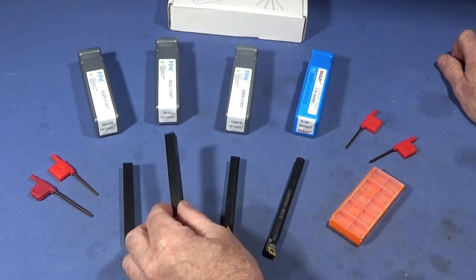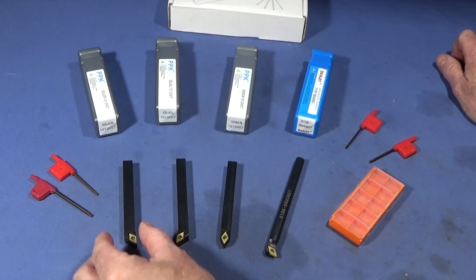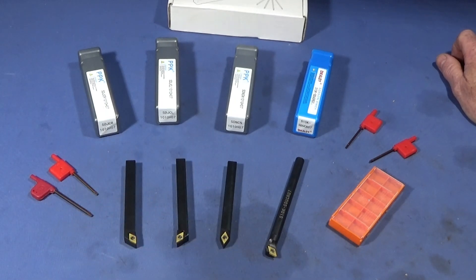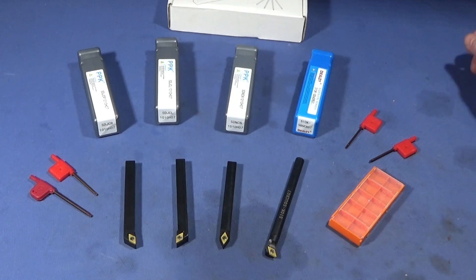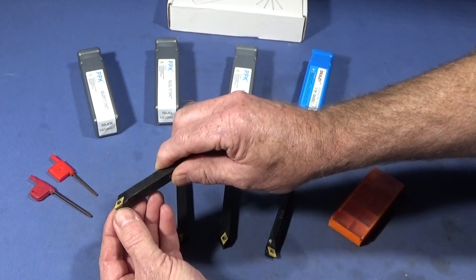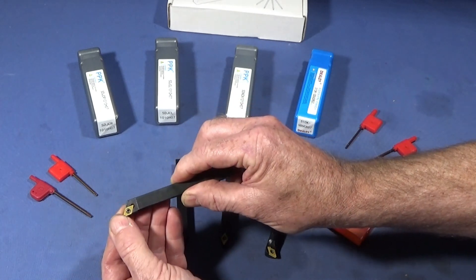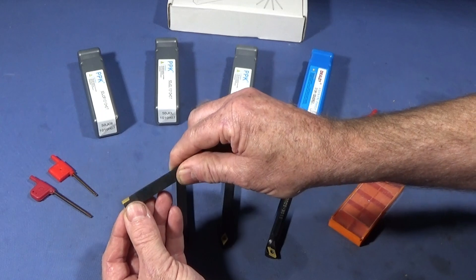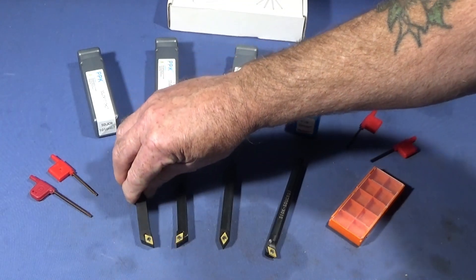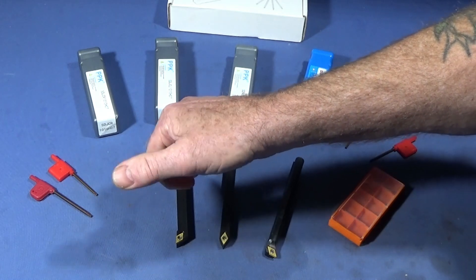Now I'm going to go through the various different tools in this set and show beginners the types of cuts each tool can make and the operations they can do. I'll demonstrate that on the Myford ML7 on a piece of aluminium. Before I do that, I should mention that these are titanium coated inserts. If you're new to insert tooling, there are various different grades available. I use these titanium inserts for stainless steel and hard materials, but you can also get blue nano inserts which are even harder. These titanium coated ones are very low cost and the set is really economical to use.